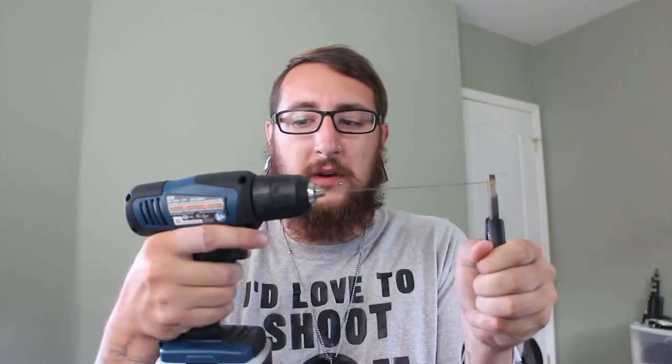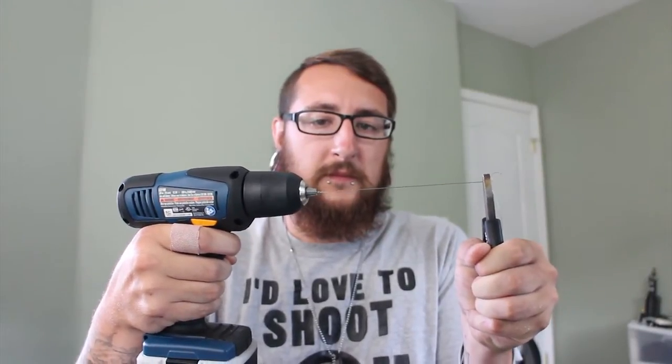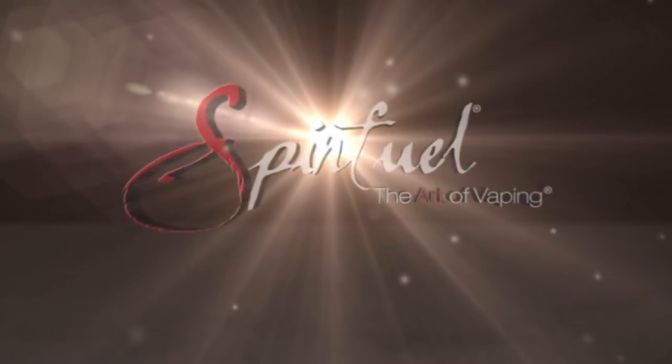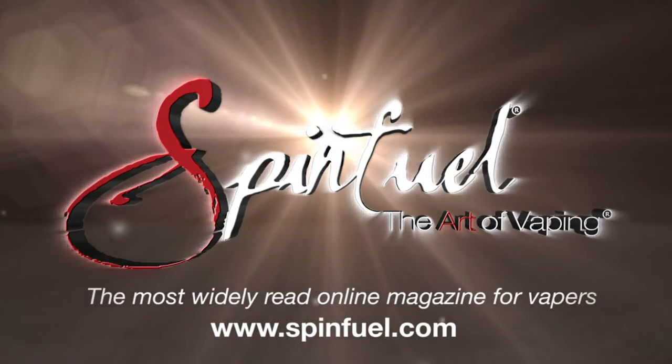Now what you're going to do is grab the wires by the little wrap that you made, hold them nice and tight, and start the drill. You want to start it pretty slow and work your way up. So here's the finished product. I just clipped the ends off of the twisted ends and you get something like this. I'll show you in the close ups — it looks a little bit messy, it kind of maybe has a few gaps in there, but I have a feeling that that won't really matter. So let's go down to the close ups and build a coil with it.